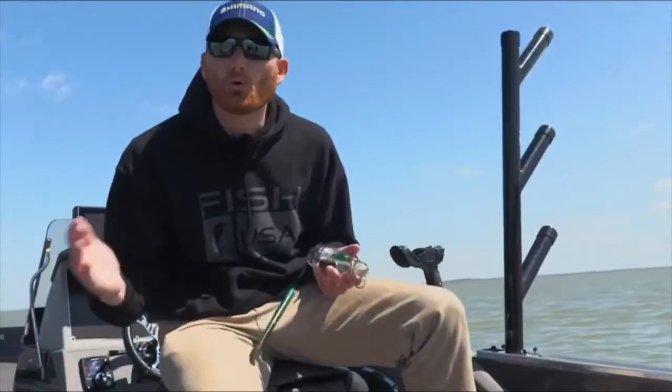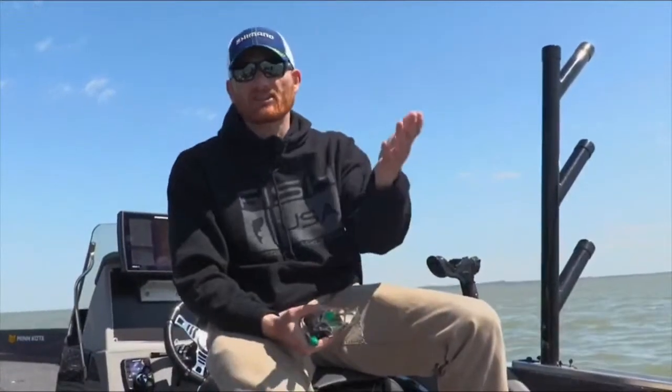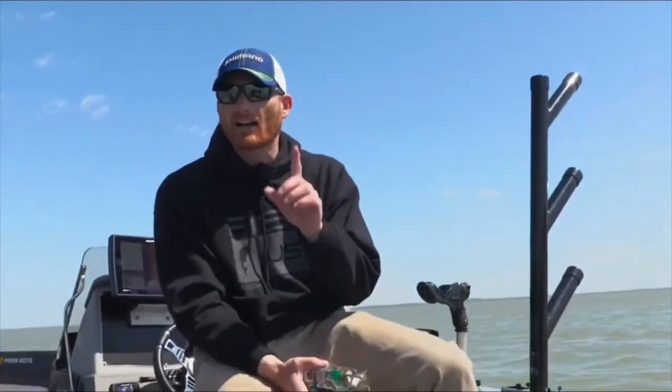I'm frequently asked, what is a Fish Hawk? And simply put, a Fish Hawk is a speed and temp probe. While temperature is pretty obvious, the speed thing allows us to adjust for underwater currents. Believe it or not, what your speed over ground on your GPS is and what your lures are doing are often two different things. And understanding that is really the way to unlock how to catch more fish.